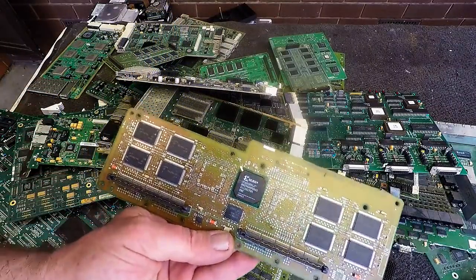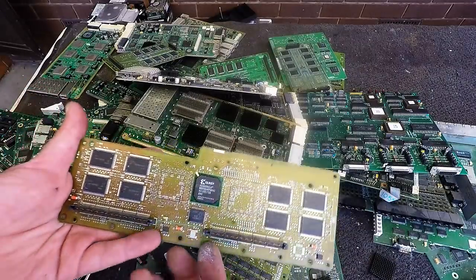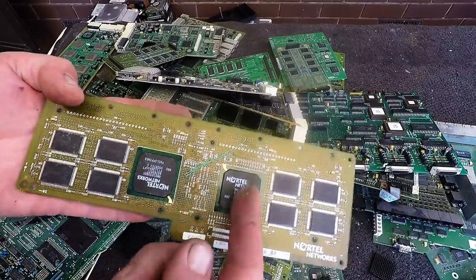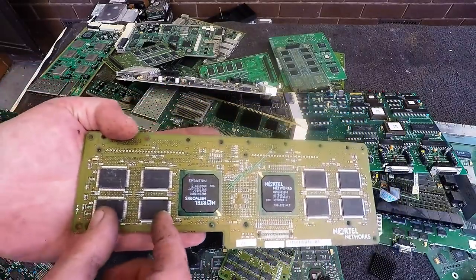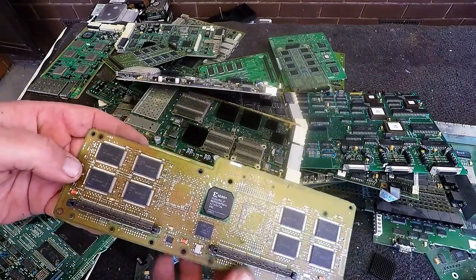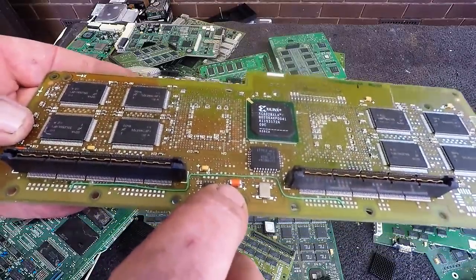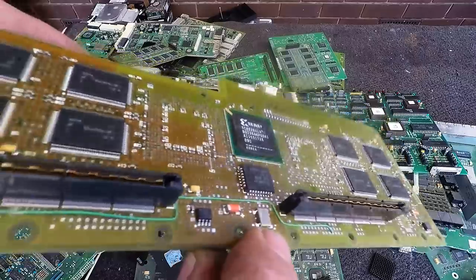Another example, telecom grade board, because it's only populated with chips. Other side, it's even better. Two massive BGA gold corners, flat packs on each side. Another little BGA there, even though a nice CCC tantalum capacitor, crystal oscillator, telecom.